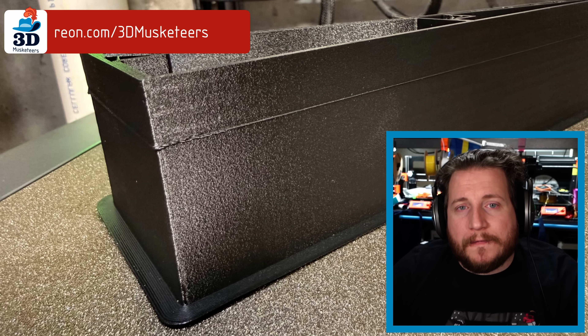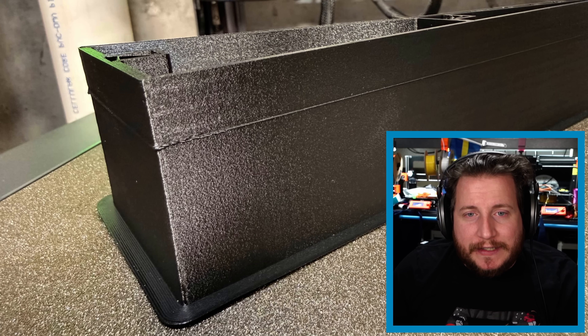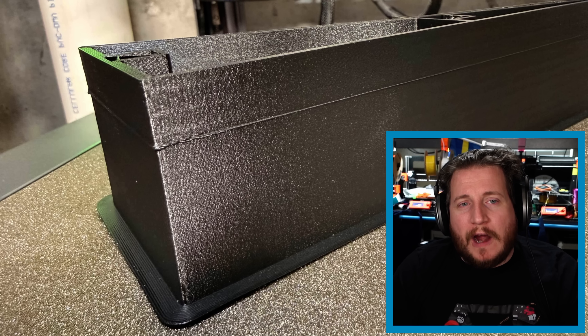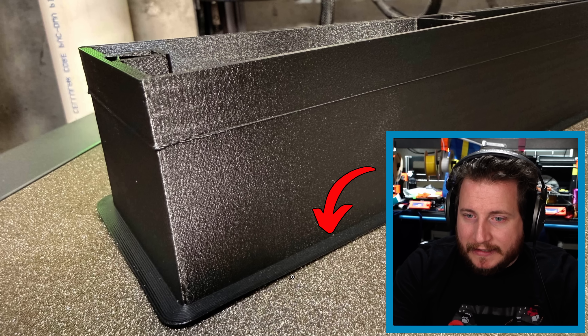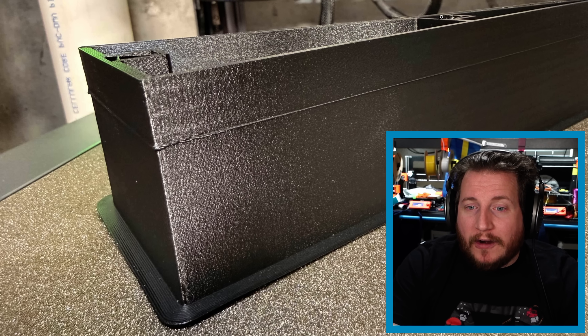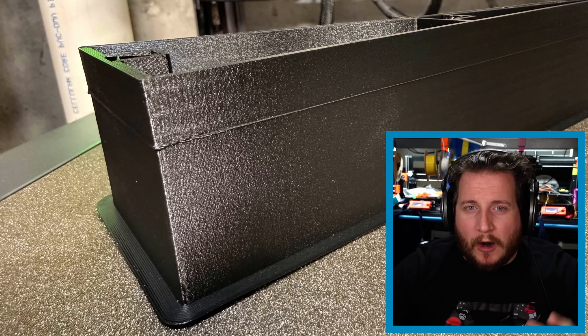Next, from our fan Discord: Pierce Prints 3D is asking why there's a visible line in their print. They're printing in PETG-CF and the part looks pretty decent overall — that nice clean PETG look with carbon fiber that eliminates most layer lines — except for one very obvious line about three quarters of the way up. Looking at it, the part has clearly warped and pulled up from the build plate. This is a Sovol SV08 or SV08 Max, and the part is at a diagonal, so it's probably quite large.